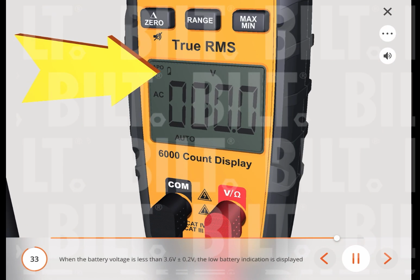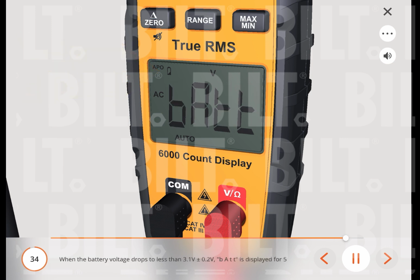When the battery voltage is less than 3.6 volts plus or minus 0.2 volts, the low battery indication is displayed on the screen. The meter will still work normally. When the battery voltage drops to less than 3.1 volts plus or minus 0.2 volts, BATT is displayed for 5 seconds then shuts off. When the battery voltage is less than 2.3 volts, accuracy is no longer assured.